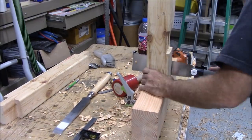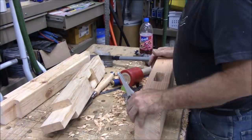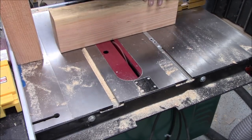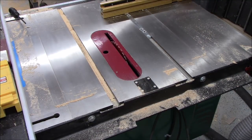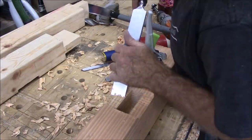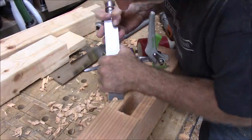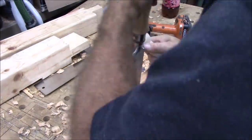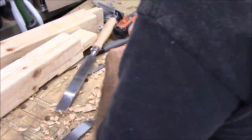I'm using the MFT right now but that is not made for this — it's wiggling around quite a bit. One of the plans for this winter is to go ahead and get a nice solid workbench that I can put this together on. Again, cutting more of the mortises and using the table saw and band saw when I can. Now if I was working on larger pieces, this would have to be done more by hand, but these are small enough that I can use the table saw and get them cleaned out.